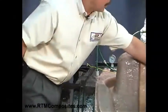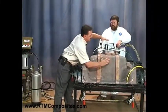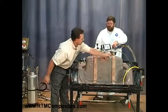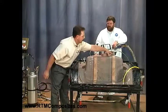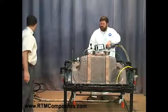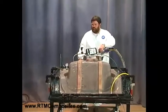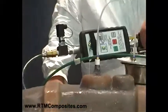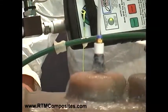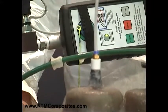We're now up to this area — we've got a spot converging right here, just starting up this sink basin drain port. It's going to go over all that and end up at the top of this drain port as the final point. We're at 4 kilograms and we've just switched down to 10 grams a second. This enables us to fill rapidly, slow down a bit, then creep the last bit. The whole idea is to prevent opening the mold — we want a uniform cavity. We spend many hours building an accurate tool and don't want to spread it open from hydraulic resin pressure.